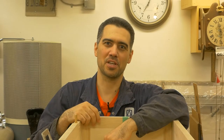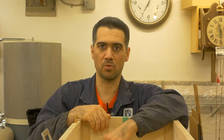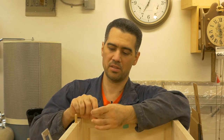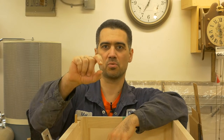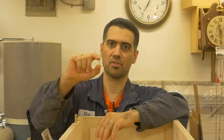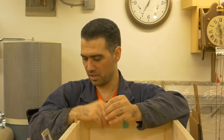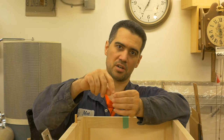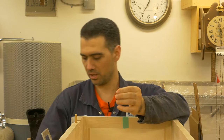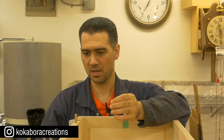And the surgery was a success, and now the dowel is gluing where the screw was previously sitting. And this is the screw that was inside the wood, and I'm gonna bring a close-up picture with my square so that you can see the full length of what was inside. It was about 2.1 centimeters inside the wood. So what I did with my little drill is enlarge the hole around the screw and then use the pliers to twist it out of its place.